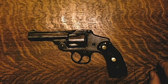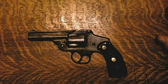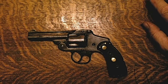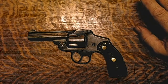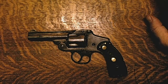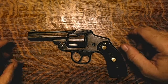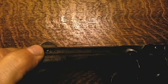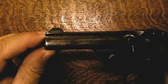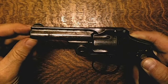It's kind of hard to tell because the Model 5s and Model 4s serial numbers look like they might have overlapped a little bit. I've been trolling the net for a couple of hours and some people say the Model 4s ended at 220,000 and the 5s picked up there, but others say the 5s started at 200,000 with some overlap. I personally believe this is a Model 4 because most Model 5s have an integral front sight, whereas on this one you can clearly see there's a pin holding the front sight in. With this 205,000 series serial number and the pinned front sight, I believe this is a Model 4.